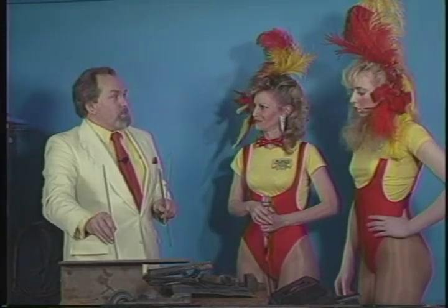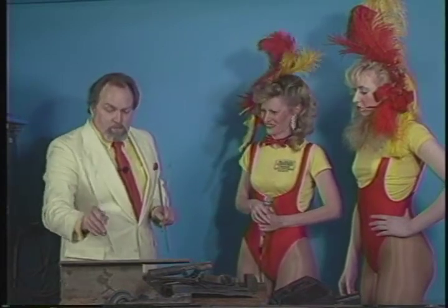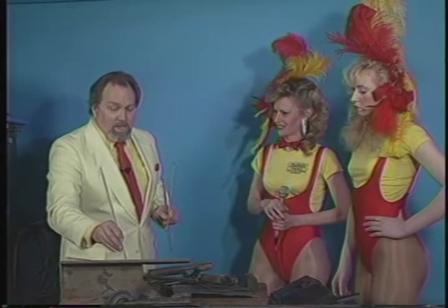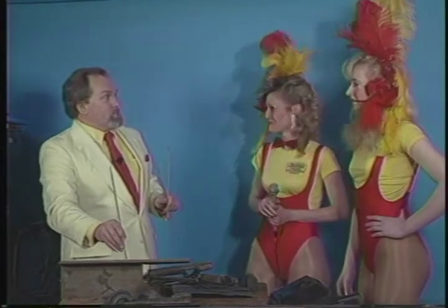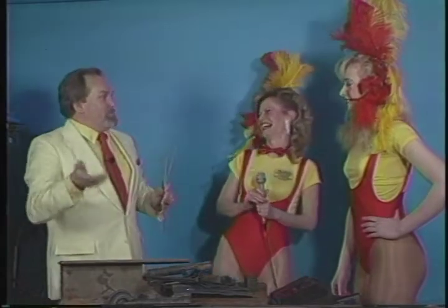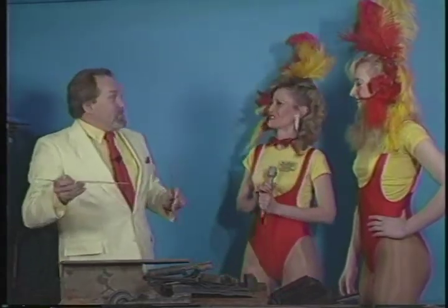They'll strike that arc, and instead of scratching it across quickly and picking up so that the arc stays established, they'll go like that. It'll stick to it, and then the machine goes, and this whole thing, you can see it turn cherry red, and they blow fuses and all that. It's sort of funny. But it's real aggravating when it's happening.